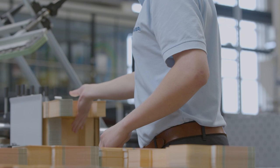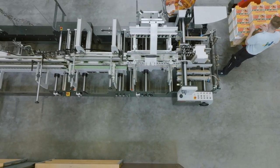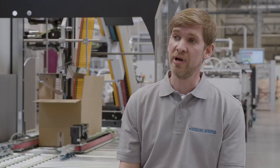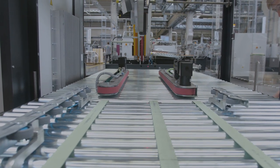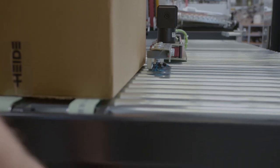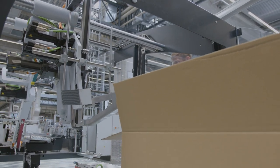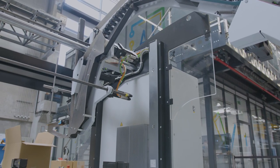The SmartPacker now clearly closes the gap in our product portfolio when it comes to filling folding cartons into shipping cases. We offer a simple packing table, then a semi-automatic packing solution — the easy packer — handling speeds up to 60,000 to 80,000 boxes an hour. With the SmartPacker we handle speeds up to 130,000 boxes an hour, and then we offer our fully automatic solution, the DIANA Packer 4.0, handling speeds up to 200,000 boxes or more. We also have a reliable box count advantage on setup time because you don't have to set kickers at the folder gluers, and it may enable higher production speeds while reducing production stops caused by the kicking device.